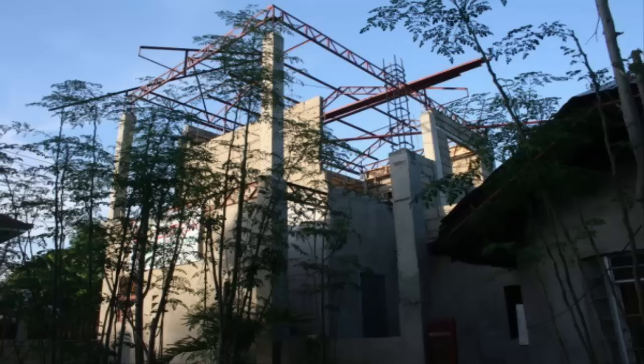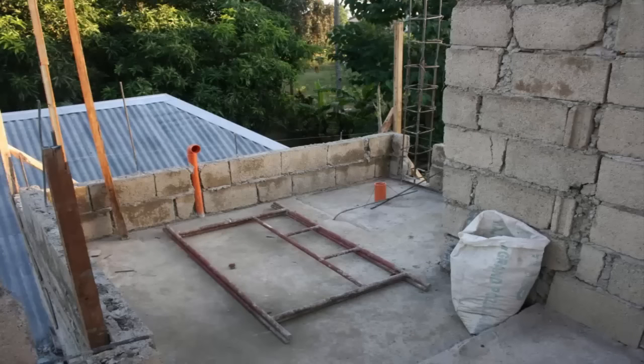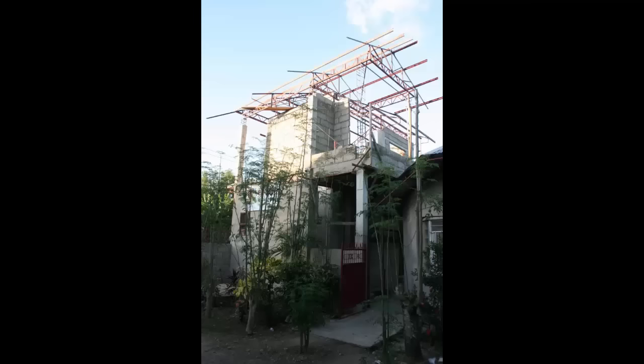As you can see here, the pillar on the far right is being carried up and it is in an open space. This is where we decided to extend over for a new bathroom to make a bit more room in the apartment, but obviously it is an open space above the gate. What we did is basically carry some steel across, join it up with the steel post coming up, put a piece of plywood down, form a concrete base on there, and then rip the plywood out once it all dried below it.